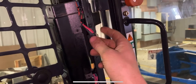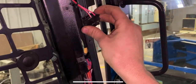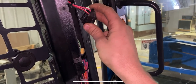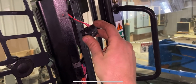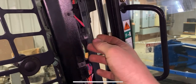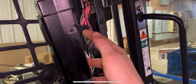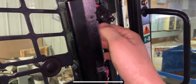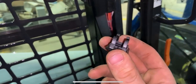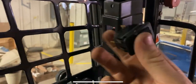It's always good to use something like a test light or a multimeter to verify your power and grounds and how much power you have — that was how I figured out that the other plug was actually my error, I had the incorrect plug in my hand. So that was how I decided I needed to check this side and found the correct one. To get these little face plates out, all you're going to do is come around the back here — these pop out real easy just like that. You can see it's just got some little fingers on it.